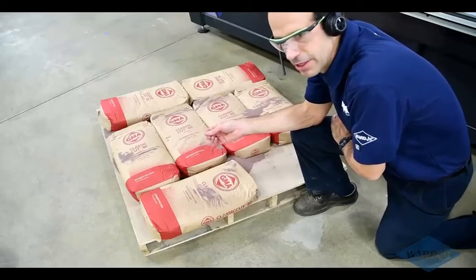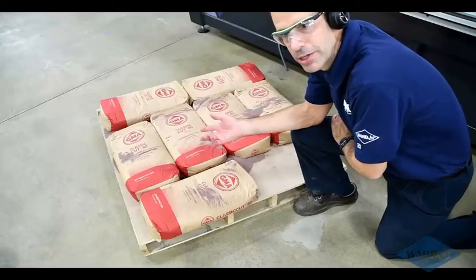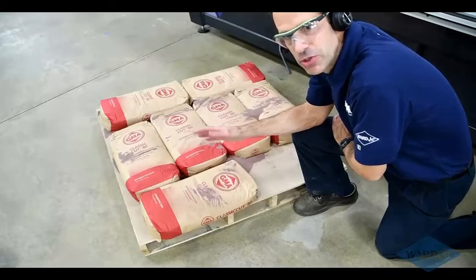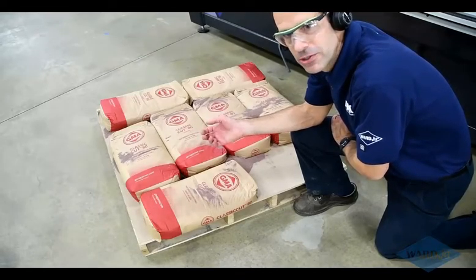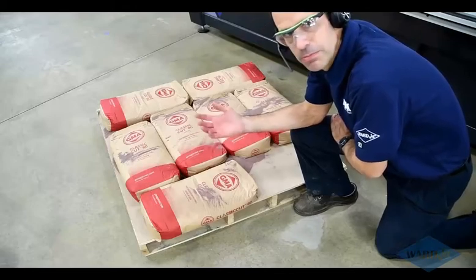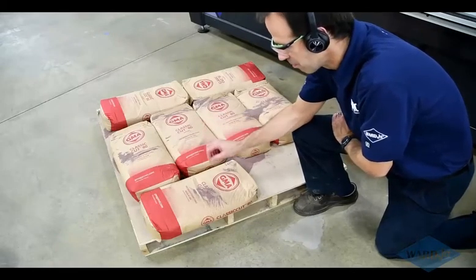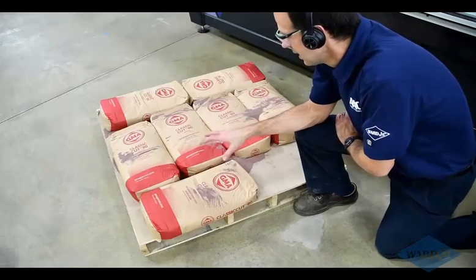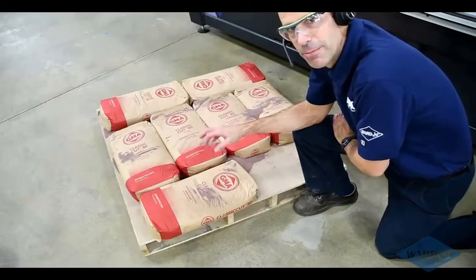If you're doing very thin material and you want to reduce burr on the backside, you could go with a 120 mesh. And then sometimes people cutting glass, they want a much smoother edge, they can go again with a 120 mesh or even a 220 mesh. So the finer the mesh, the smoother the edge is going to be. You'll also have to cut a little bit slower because each little particle of abrasive has a little bit less power to it. So now we'll go ahead and take a look at our bulk feed hopper options.